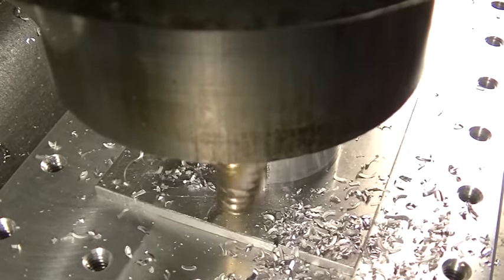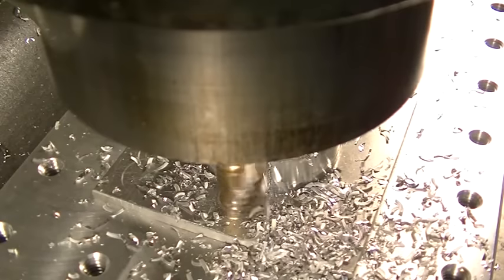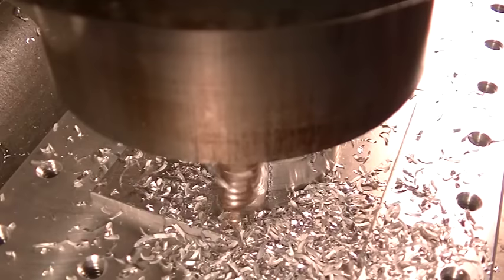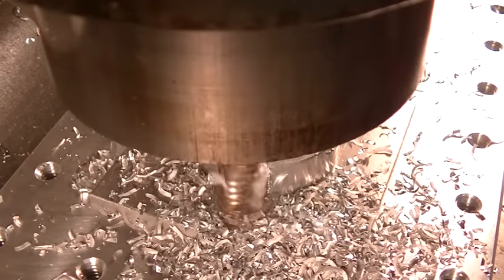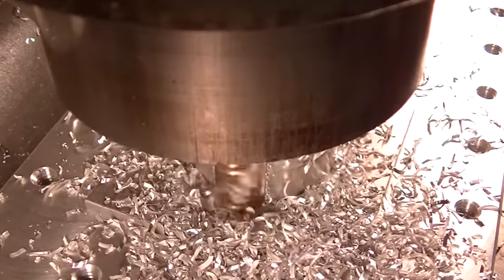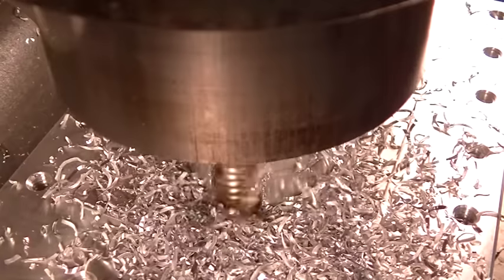A small mill, so I get a little bit of vibration, not a Bridgeport. The width of the jaws is 7/16, so I'm using a half inch end mill. Give me a 32nd on either side, and most of this just by eye. This is not something you have to be real accurate about, because they'll probably only use it once and maybe never use it again, so it's just a temporary jig.